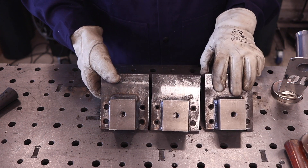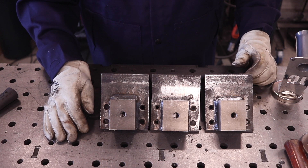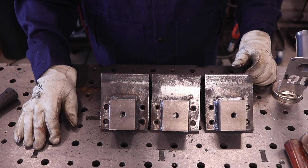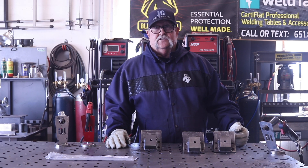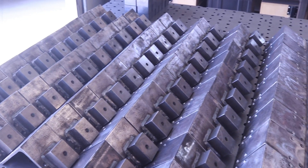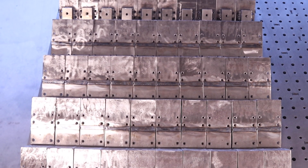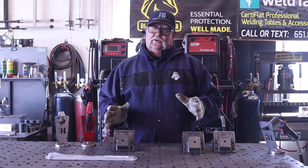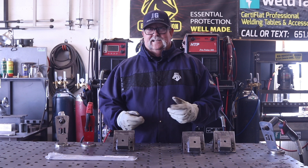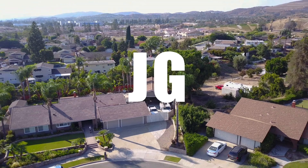So there's all three of them — all three are going to work just fine. But for me the best one is going to be the spray arc MIG: it's the fastest, the cleanest, and the easiest in this application. There's a place in fabrication for all three processes for sure, but for this particular project the spray arc MIG is the way to go. I hope you guys enjoyed the video. Check out jimbosgarage.com, follow on Instagram, check us out on Facebook. I've got 100 of these to do — already got 50 complete. See you next time on Jimbo's Garage.